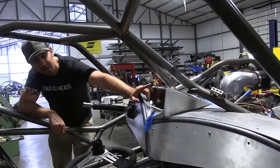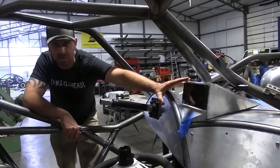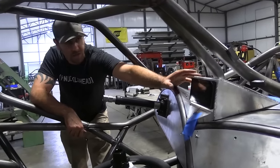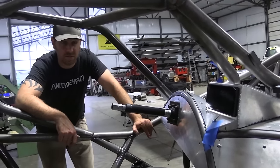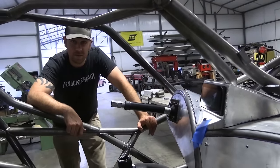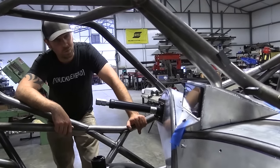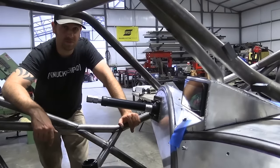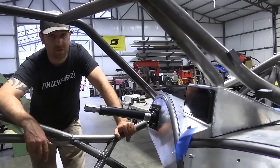Now this Holley EFI dashboard right here is actually gonna be all the gauges and give the ability to change the tunes on the fly. So if he decides that he wants to go out, we'll be able to throw him a 93 octane tune. It'll pull some of the timing out, and he should be able to drive it and just go play. If he decides that he wants to get wild with it, flip over to the performance tune and throw in some 116 octane, and he should be able to rock out pretty hard.